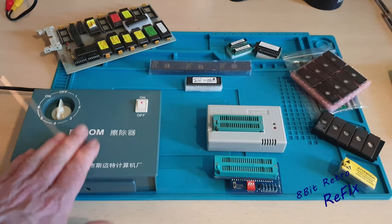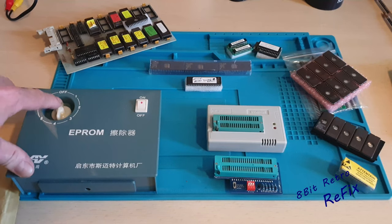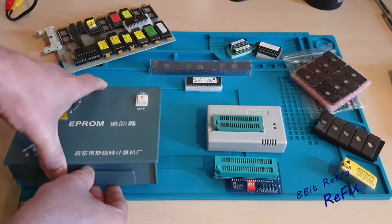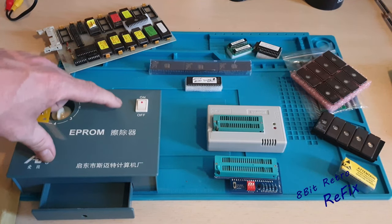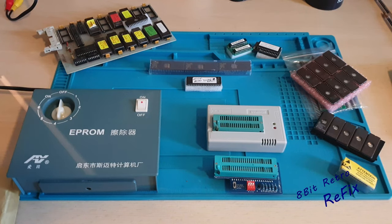You can see here - this is a timer box. Spin the clock around, switch it on, open the little drawer - there was a handle for it at one time - open the drawer, pop your EPROM in, and just let the timer run out. I'll show you back when we get to the PC screen what happens when you don't erase the chips or you haven't got an erased chip. So you've got to erase the old ones using that little UV window.